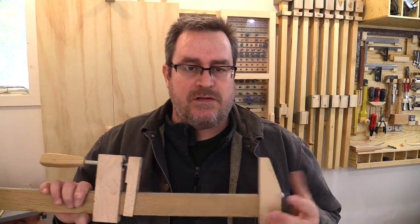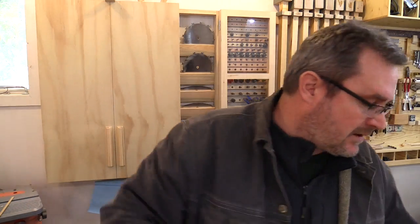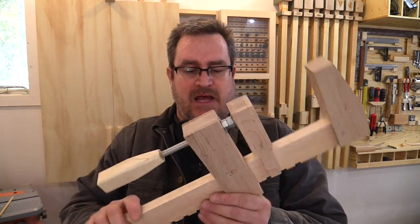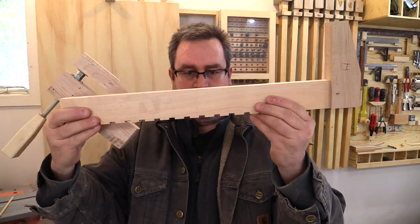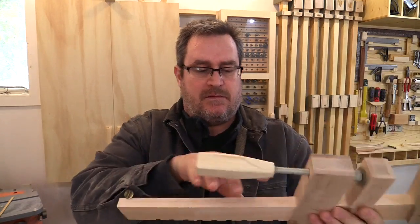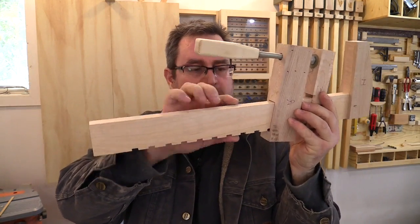The next comment had to do with what kind of wood you could use. You can use any hardwood to build one of these clamps. You could probably even do it with softwood, if it's a harder variety — really soft white pine wouldn't work as well, obviously. But good, well-seasoned Douglas fir would work well. The main problem is that the bar will flex and bend. And another problem is that this point right back here can dig into the wood as well, so better use hardwood.